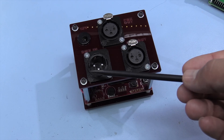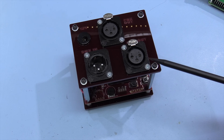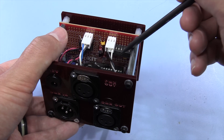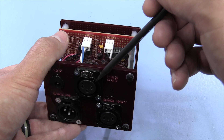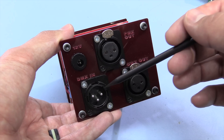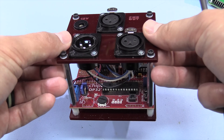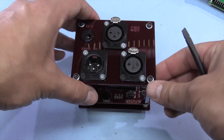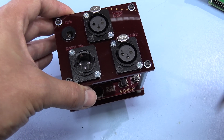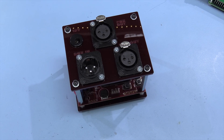I've designed a little box that converts the DMX interface into a PMX interface for controlling these lights, while passing the DMX through for normal DMX fixtures. It uses a ChipKIT DP32 development board, which has a little prototyping space. I've added a MAX233 for creating the voltage levels for the PMX interface — which is basically a single-ended RS232 interface — and a MAX485 transceiver for receiving the DMX differential pair and feeding it to the UART on the PIC32. It's all housed in cut acrylic with XLR connectors, and probably cost about £20 and two hours of programming.